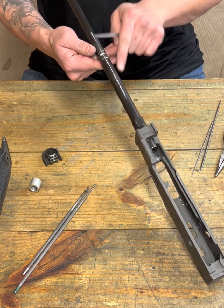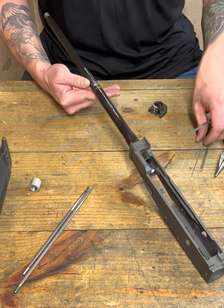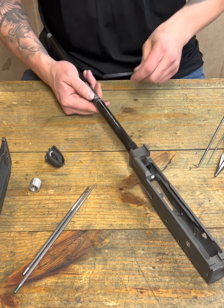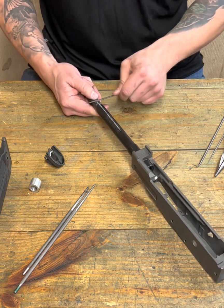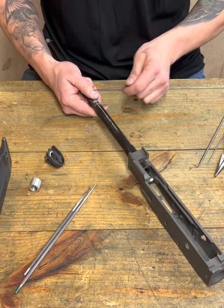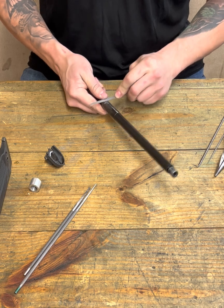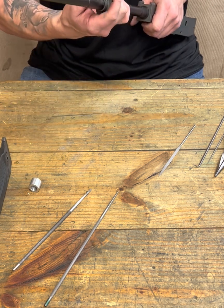now we're removing material from this shoulder, if you will, and we're doing so at a bevel, which means we're changing the bottom line of where this pin is going to cam into. And that's where we want to get this nice and tight. So we can sit here and make adjustments with our half round, and at the same time polish this out to remove the more aggressive tool marks from the rat tail. The rat tail was good for what it needed to do. But now we need a little bit more finesse, if you will. Let's give it a check anyway. If you ever have an idea that you want to check it, stop and check it.